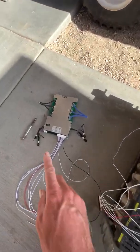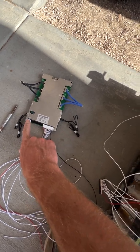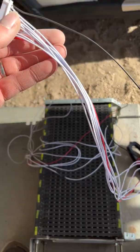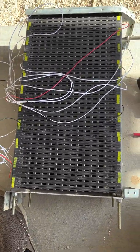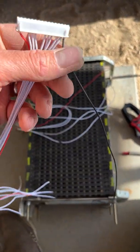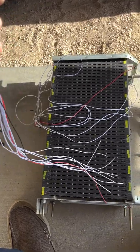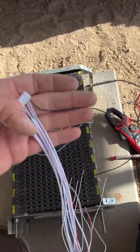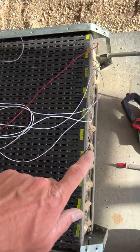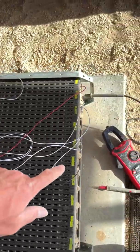We're just going to keep going with this lead and then plug them all in. We should be able to plug in the Bluetooth module and see what the BMS is doing. Next we hook up the other half — working our way backwards from the negative side, to make sure everything lines up and we didn't skip a cell by accident. If everything is done correctly there should be no overlap. When we get to this red wire it should land on the correct series connection.